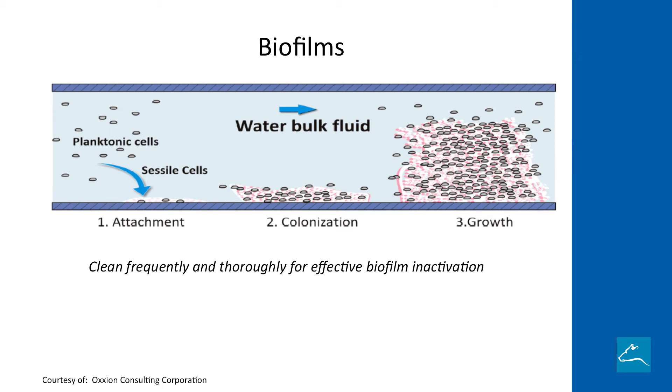What are biofilms? Biofilms are nothing more than colonies or large growths of different types of bacteria within water-holding systems. Bacteria cells will float around in the liquid. They can attach to the surface of the equipment or whatever it might be. They actually can form colonies that grow and get big. It's very difficult for disinfectants to penetrate these colonies. That's why it becomes very, very important not to let these biofilms start in the first place. We have to stay ahead of them with very aggressive cleaning, washing, and disinfection.